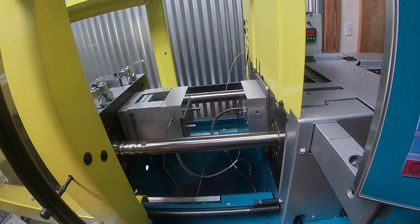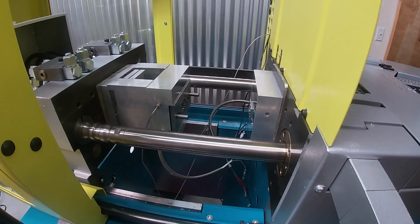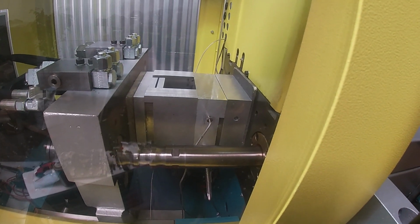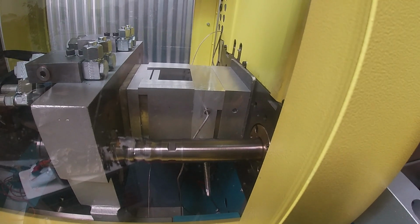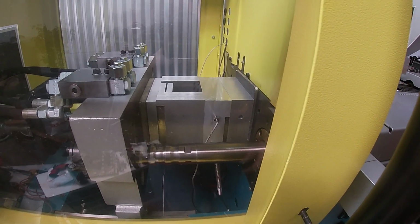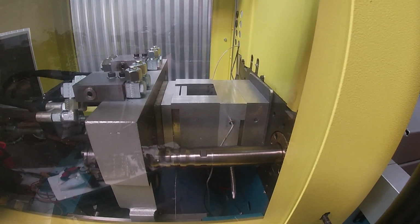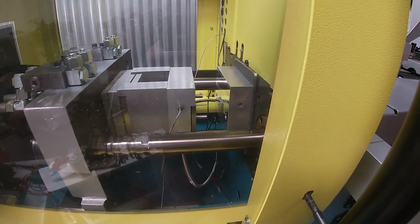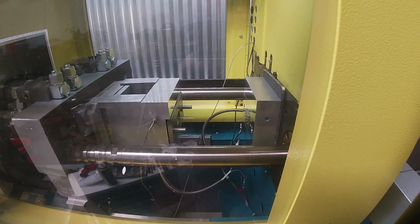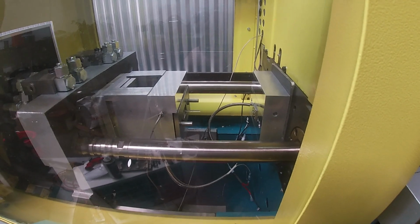All right, but let's go ahead and fire it up again. Right now I got the ejector pins forward, but this molding machine knows that if I'm telling it to mold another shot, it's going to pull those pins back before it closes the mold. So you can see how it pulled it back, and then we close. You see there's some pushback from the stripper plate springs, so the molding machine had to hesitate a second. You set the pressure on the clamp to sense for obstruction, so it sensed that spring was there and it slowed down. I can increase the clamp pressure before it actually locks up and does the 15 tons of pressure. But it's also tricky because if you do have a part that's stuck, then you can damage your mold or smash the part in there. So having mold springs is tricky because you lose the sensitivity that the machine has to see if there's a part stuck between the two mold halves.